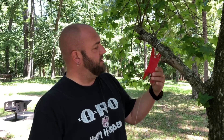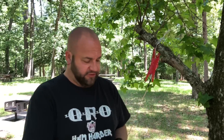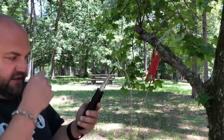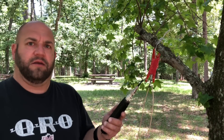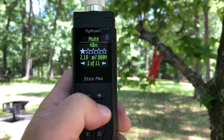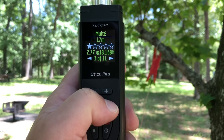We are at the K8MRD Proving Grounds, also known as Huntsville State Park. We've got the X-Tenna right here. It's currently switched to the 49 to 1 position, and I'm just going to hit the multi button on the Rig Expert just to see where we're at. This is just with all of the wire stretched out — 70 feet, he says. I don't really expect it to be resonant anywhere, but we have to take an initial reading. One star on 40 — that's not good. Not good on 20, not good on 17, not good on 15.